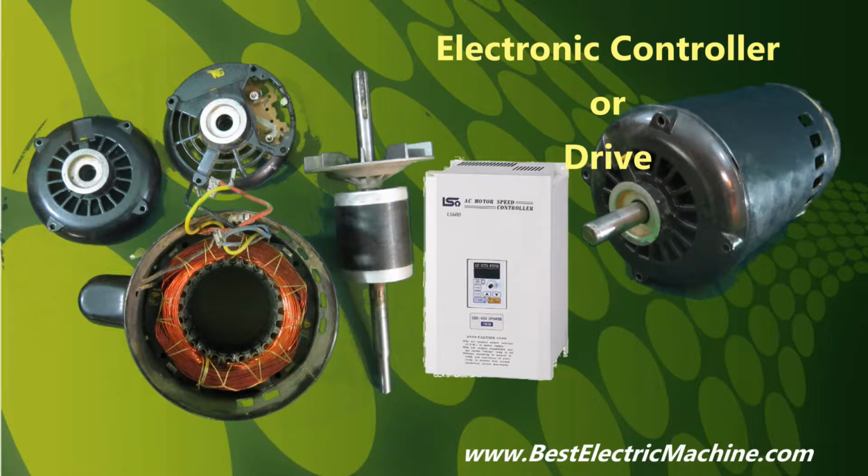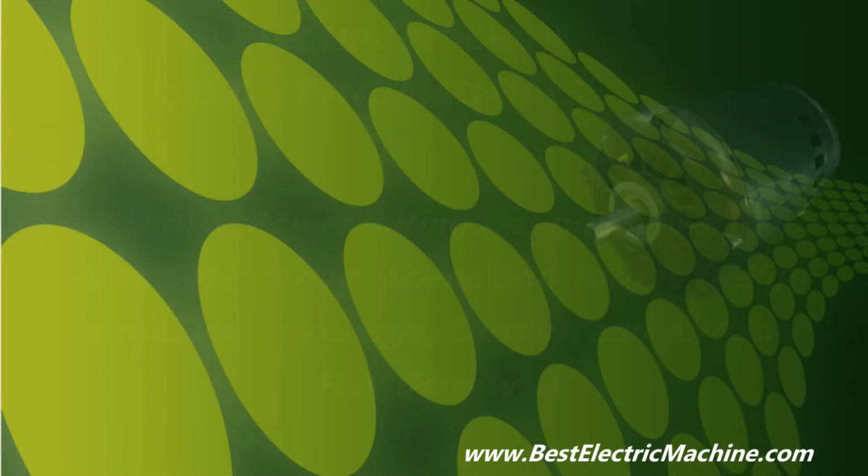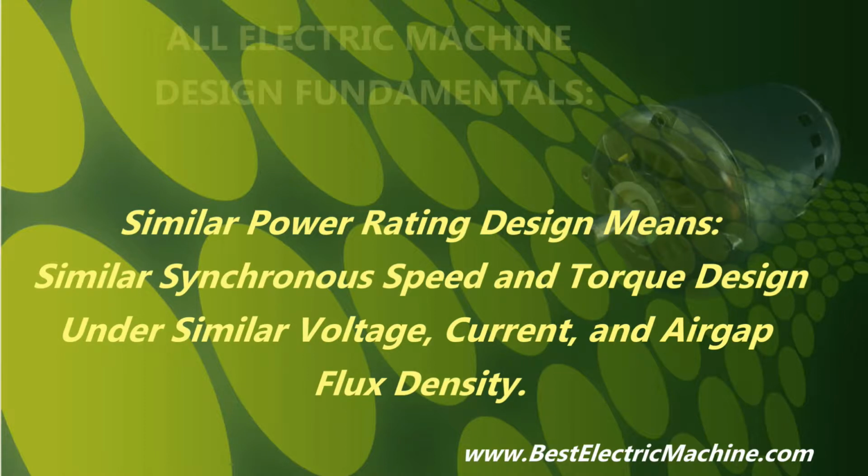Note, the electronic controller, or drive, of any electric machine compounds the loss, cost, and size of the electric machine system, and as a result, should be equitably included in the overall price-performance calculation of any electric machine system. Still, it is expected that all electric machines will be electric machine systems in the near future because of significant improvement in application performance, such as varying the speed and torque to match the load, or ultra-high speed operation for higher electric machine power and specific density. All electric machines show the following basic design fundamentals.